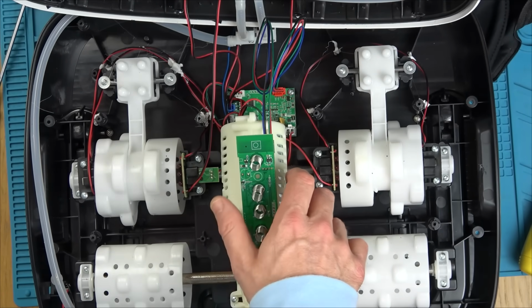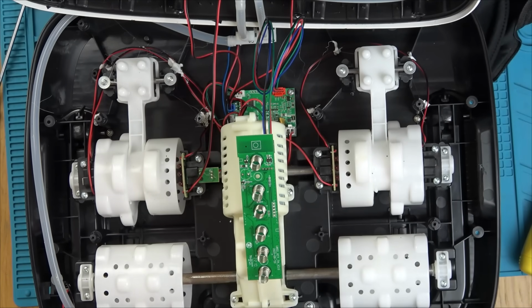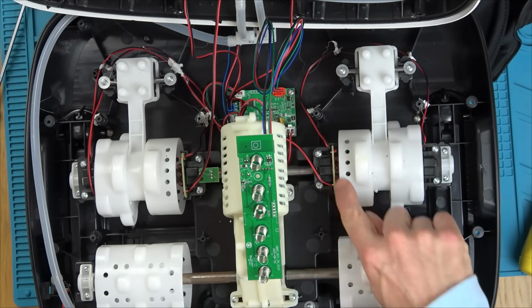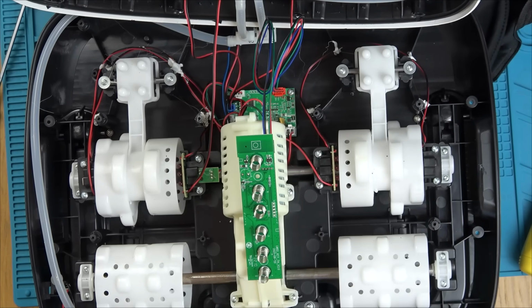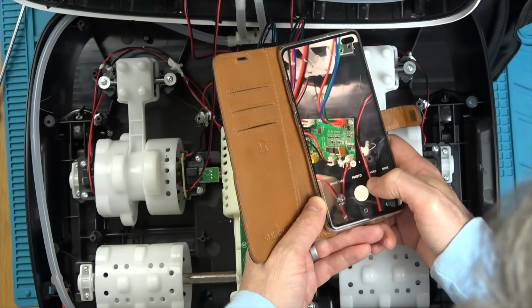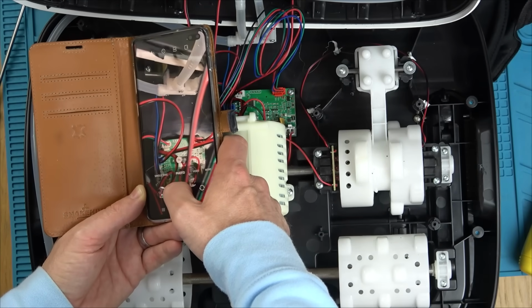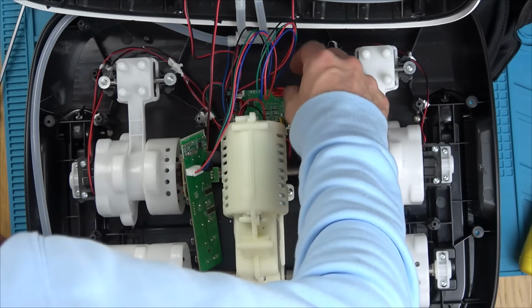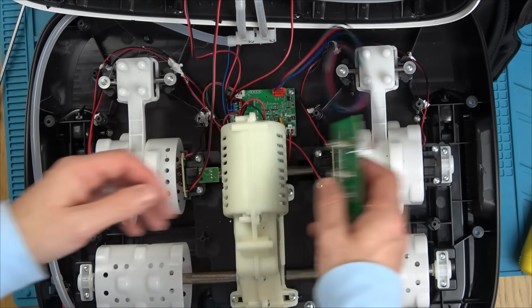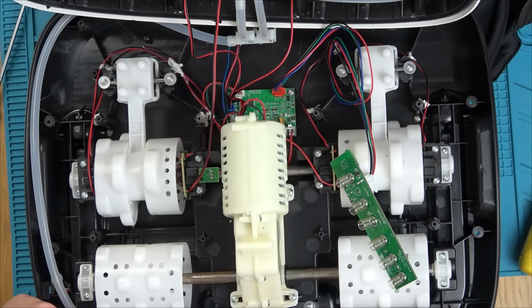Let's unplug everything from the board. I'm just going to take a picture and then we'll see if it comes on, and then we know, because it might be this thing here that's putting a fault on. That's a good idea. I'm just going to take close-up pictures so I hopefully will see what wires go where and the colours in case they're reversible. So I am going to unplug everything apart from this and the bottom board and the power connector.